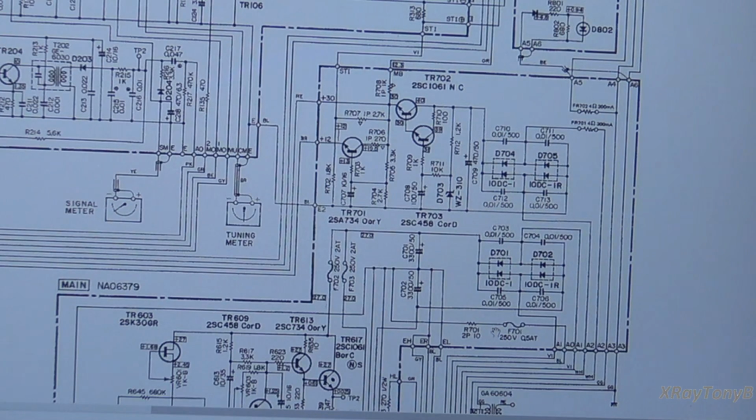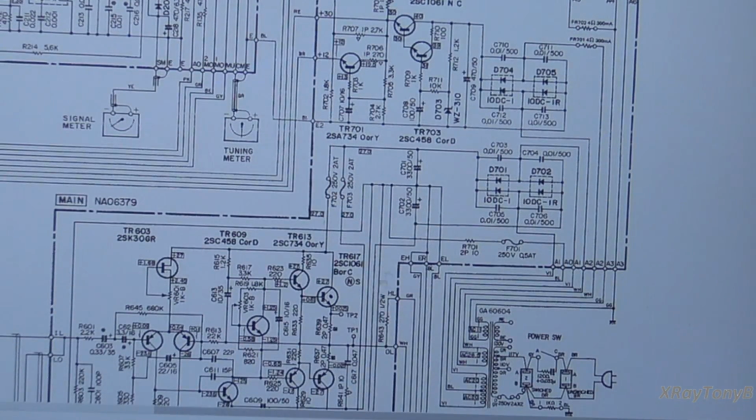At that point, you will see current flow through that center tap, and that's what this is in here for. So when the machine's first powering up, when there is some sort of transient, you can have little current spikes there, which won't hurt this fuse. But if you have a serious imbalance, like one transistor on one side shorts out, it's going to cause an imbalance and it'll open that fuse.